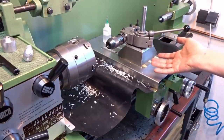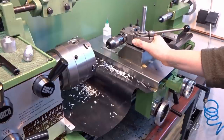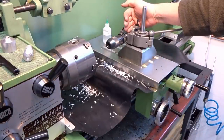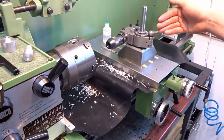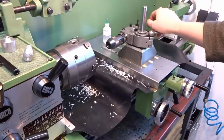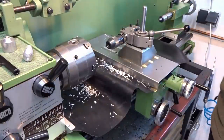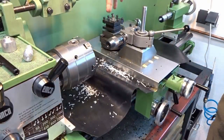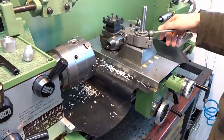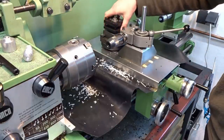Of course it's beneficial to not have a compound slide below it, because with a solid tool post like this you have the benefit of the tool post being bolted down and pinned in precision, not moving. Most importantly it stays aligned - with a compound slide you constantly change the angle to cut a chamfer or do threading. Speaking of the compound slide, I have one and I can put it back on the cross slide T-slots for taper turning if I really need to, but in the last years this has happened maybe two times. So I don't see any reason to have a compound slide on my lathe.